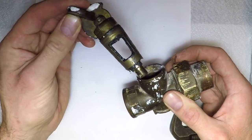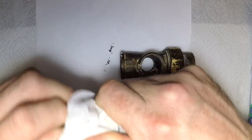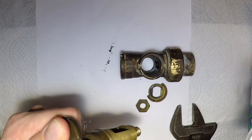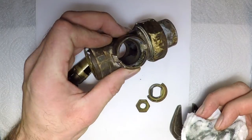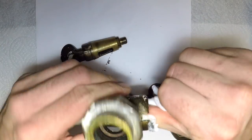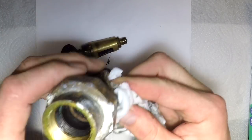Now this is something not enough people do nowadays. On a job I would use a cloth — you'll see me using a cloth, I've actually got video footage of me doing this. This had a half millibar leak from this spindle. There's the gas cock cleaned, there's the plug cleaned. You get your finger in there and give all that a clean out.